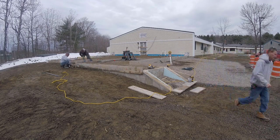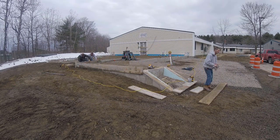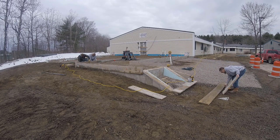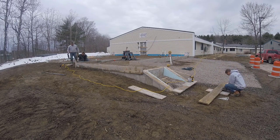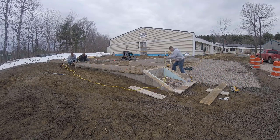So we're starting with the patio — we're getting the sides on. We're about eight inches above the top of that concrete wall for the finished patio grade, and we have a slight pitch built into the patio so the water will run off it. My guys are over there setting that last board, and then we're going to start working on the steps.